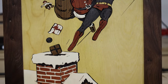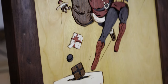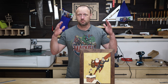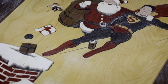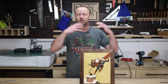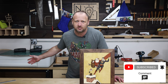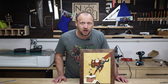What a project. This was definitely an exercise in patience. It looked like a simple project at first, but all those tiny little pieces started to add up and it became a real challenge. I'm really happy with the end results — I think it looked cool, even though we did have a few setbacks. The acrylic absolutely did not work. I sprayed a coat on, came back to apply a second coat, and the entire project had turned white — I have no idea why. I did do a lot of test sprays with test boards and everything looked perfect. So I took the whole project, sanded it all back, got all the acrylic off, and then applied a polyurethane to it — and now I think it looks pretty cool. Hopefully you enjoyed this video. If you did, consider subscribing to the channel and maybe check out my main channel, Newton Makes — I have all kinds of good woodworking stuff on there. Until we meet again, get in your shop and build something awesome.